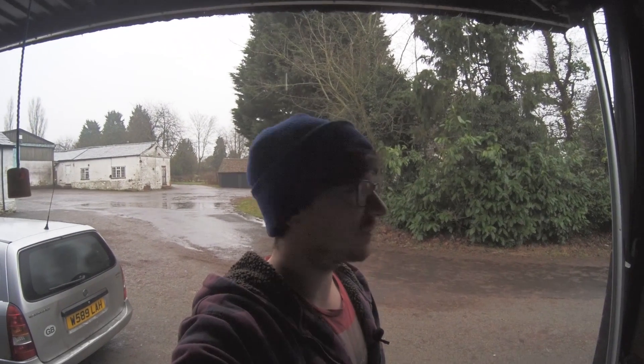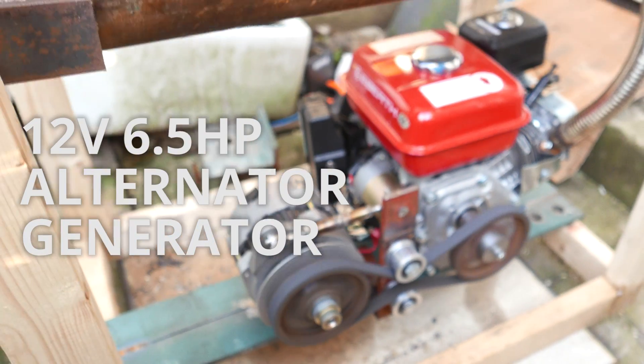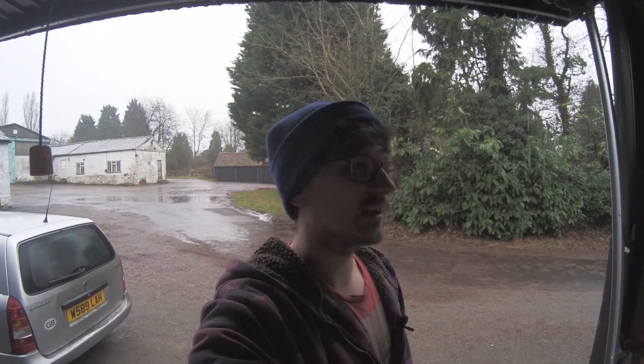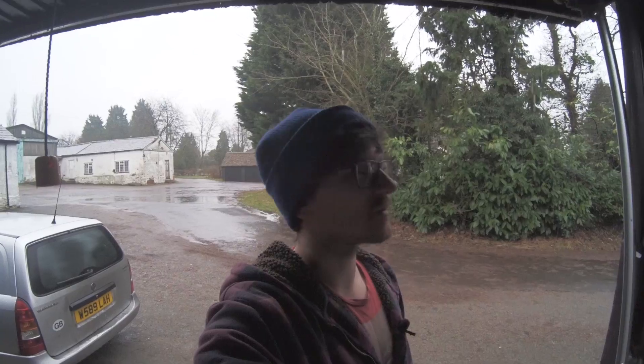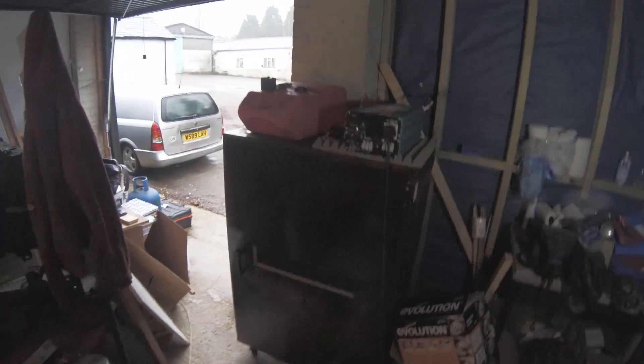What's up YouTube — I finally have my generator working and I wanted to show you how it all works. I've been building this thing for about a year. It's finally at a stage where I can switch it on: it powers up, provides about 2,000 watts of power, and it's charging the batteries — 400 amp hours at 12 volts, which is quite a lot of power.